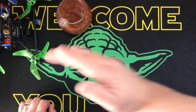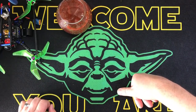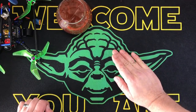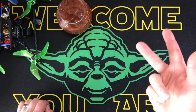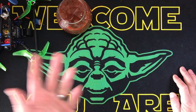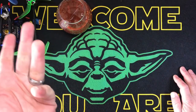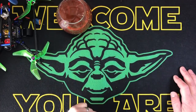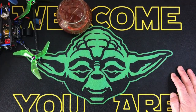I like the HGLRC stuff - that's good. Like I said, the Lumineer stuff, I order a lot off GetFPV. I kind of stick to what I'm familiar with on ESCs. I almost never have noise issues in my cameras. I've built maybe one or two birds in my life that I put a cap on for noise. If it's BL-Heli S, I'm running D-Shot 600. If it's 32, I'm running 1200. And if there's no noise, I'm a happy camper. The CL Racing and the Fortini F4 OSD flight controllers, and then the Lumineer 35-amp ESCs - those are my go-tos.